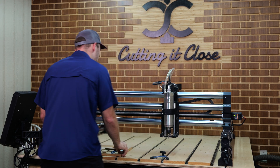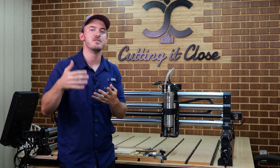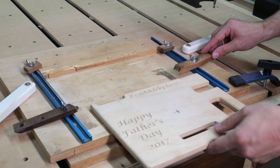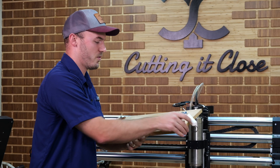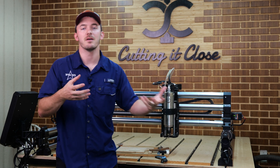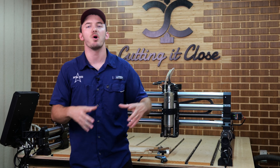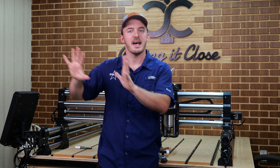The last thing you want to look at is your current situation. How do you get your changeout time down from five minutes to three minutes so that the vacuum table only saves you one minute per changeout? This jig I made for my docking stations — I screw it down to the table, put the docking station in, turn a little lever, and it holds everything down. For my smaller CNC, I figured out I could make different jigs a lot quicker and reduce changeout times, so I didn't need the vacuum table until I bought a four-by-eight CNC where the math actually made sense.